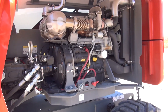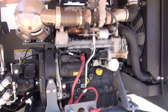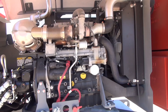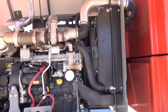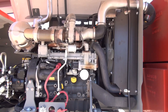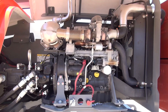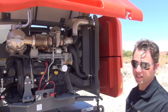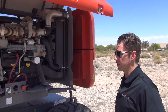The engine on this machine is the Deutz TD 2.9 — their 74 horsepower turbo diesel engine. We also have available as an export engine the previous-tiered D2011 four-cylinder engine, for countries that don't have ultra low sulfur fuel available. This engine does have after-treatment. It is Tier 4 compliant but just has a diesel oxidation catalyst, so it's basically maintenance-free — it doesn't have a DPF or SCR.